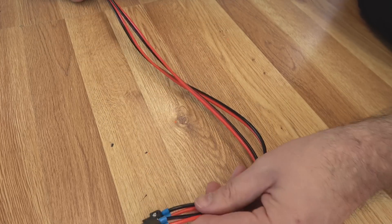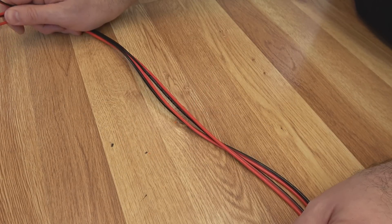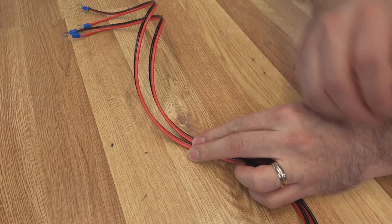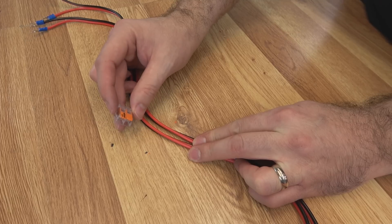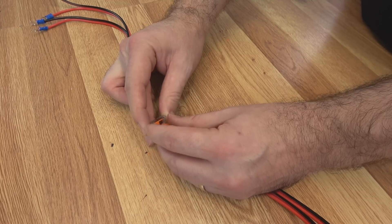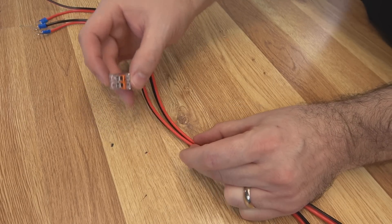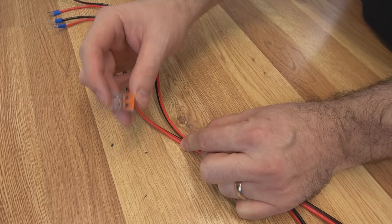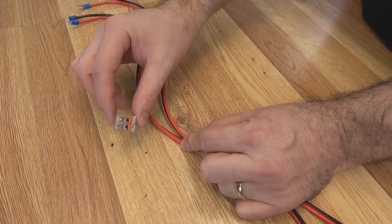We've added just a little bit of length. Now I did all this work putting these connectors on, but I'm actually going to cut these in half — and there's a reason. It's because that bottom enclosure is going to be more permanent than the top one; I can't just take the top off of that bottom enclosure. So I am going to splice all the wires with these WAGO connectors so I could remove them if I want to. I don't anticipate having to do it a lot, but these are just locked-down connectors rated for 20 amps each. We have four different wires here — two complete runs to power the printer. We'll tack these down to the back of the enclosure and have them if we ever need to get in there.